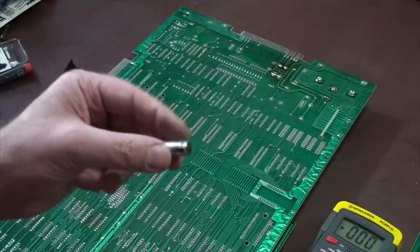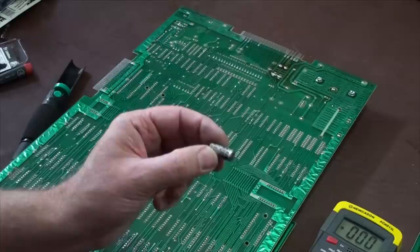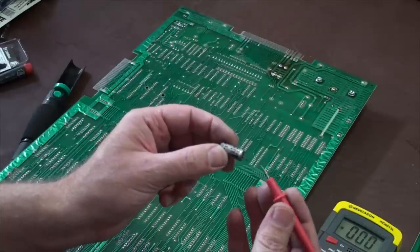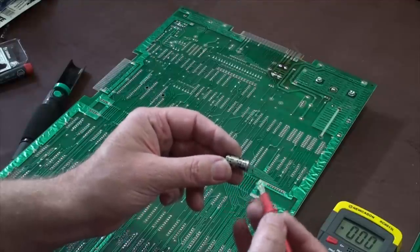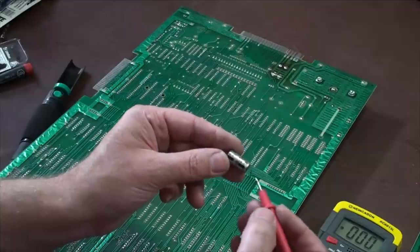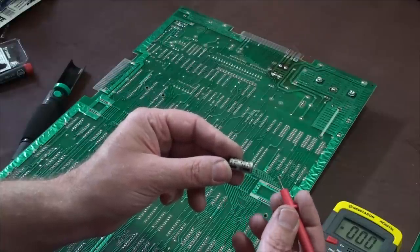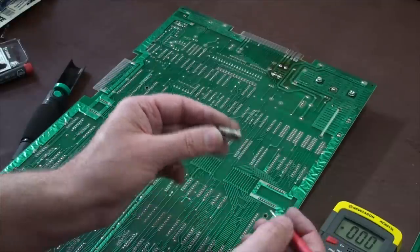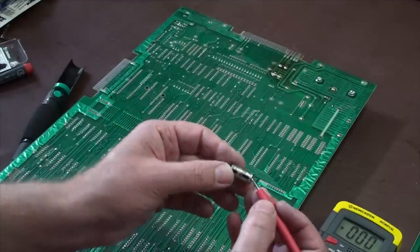So in other words, let's say I go to the local electronics place, because you don't have to order those kits and stuff like that. You can go to places locally, electronic supply places, and they have a lot of this stuff in stock. A capacitor does not have to even look like this, just as long as it's an electrolytic and it's got the same values, you can use it, right? So don't get stuck thinking it has to look the same, because this is old technology. New ones are often much smaller.